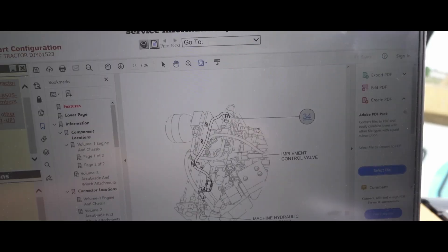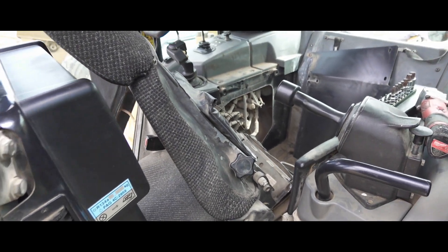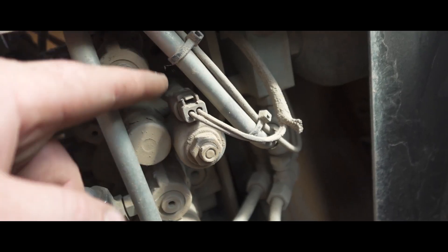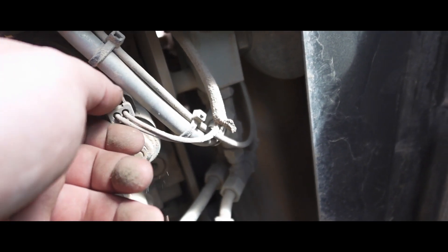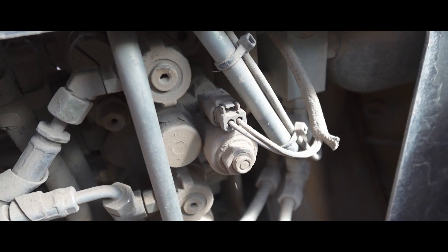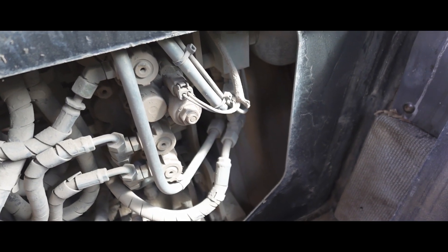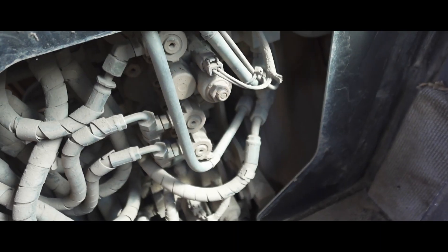According to this picture, I've got the accumulator and the coil right here. I've got the seat pushed forward and the side panel off. I think it's this one right here, so we're going to unplug it. If we unplug it and we get another code on ET then we know it's not the right one. We're going to jump this harness and see if the code changes from current below normal, and we'll check ET to see if we got a different code.